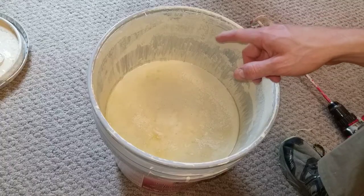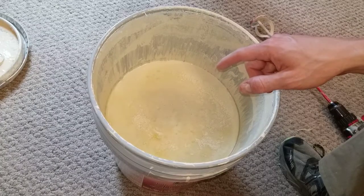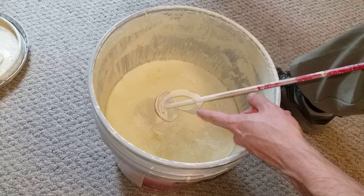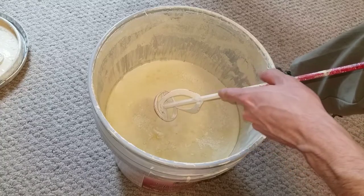As you can see, a lot of the coloring has raised to the surface, so we're going to need to sufficiently mix this to get the right color. It's very important that the stirrer is not spinning when you first enter the liquid. If you have it spinning at high speed, it'll entrap air in it.